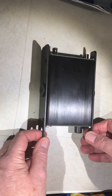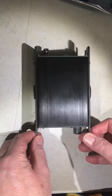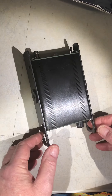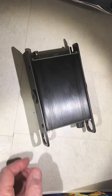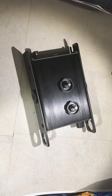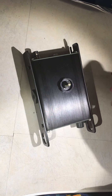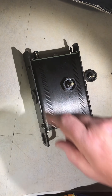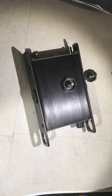So as you can see, a pair of aluminium strips — one on either side — with a cut-out for the power plug and finger holes to carry. Before I started I made sure there's clearance inside, because I wanted to put a pair of CB type knobs on it for security's sake, and adequate clearance for the length of their threads. It misses the speaker on this side quite nicely by about five mils, and there's nothing for a good inch on the other side that can interfere.